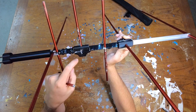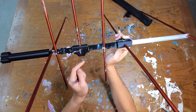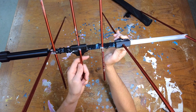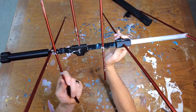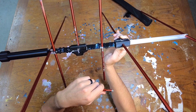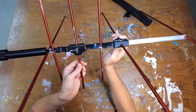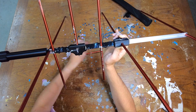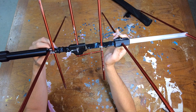You just set your little washer down inside this slot, then screw in this headless bolt, then screw your arrow on — and whenever it screws all the way up, it butts up against that washer inside, and that's what makes your contact. It's great for direction finding. It's obviously not the best connection, so if you're going to transmit through it you can't get quite as low SWR as you would with a fixed connection, but it does alright for direction finding.